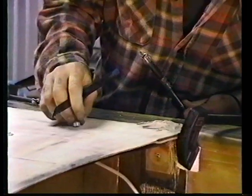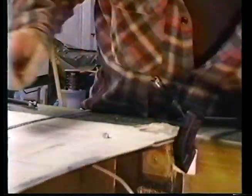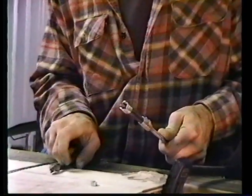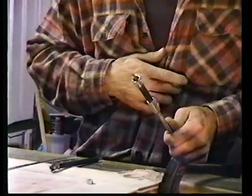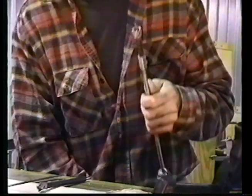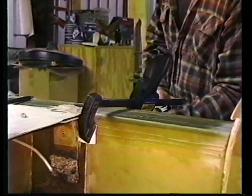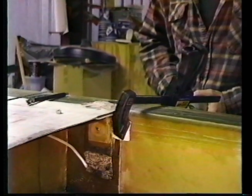It's a quarter inch. That means that we have 1/8 of an inch of aluminum left to go through on this side. And we have two types of tools that I've shown you. One that, I believe, is called a broach. It's razor sharp. Goes through like crazy, and it's self-piloting because of the barrel design on the outside of the body. We went in about two layers with the counterbore, and then we tried this tool because of how sharp it is, and it is doing a beautiful job. This is going to take no time at all to go through.